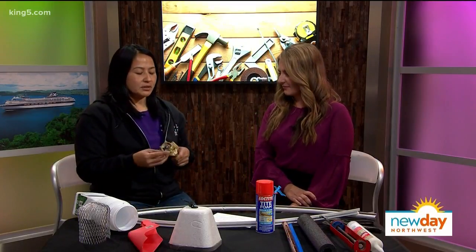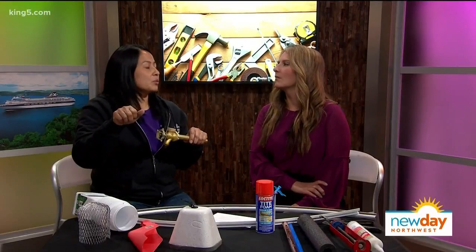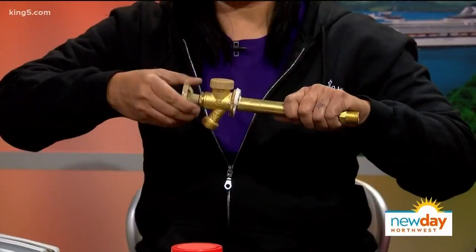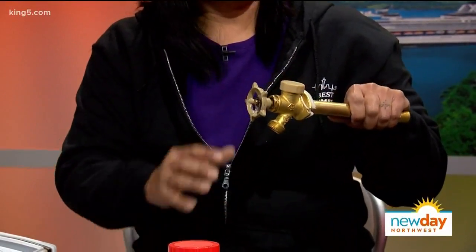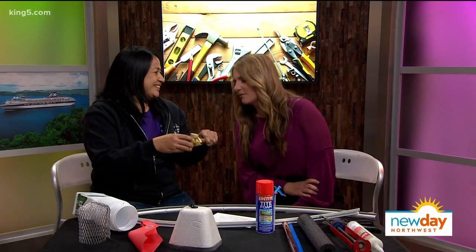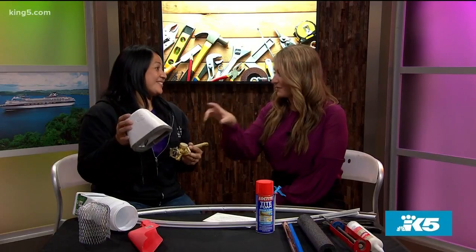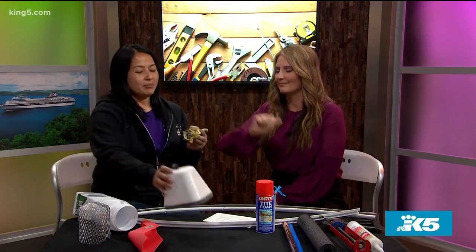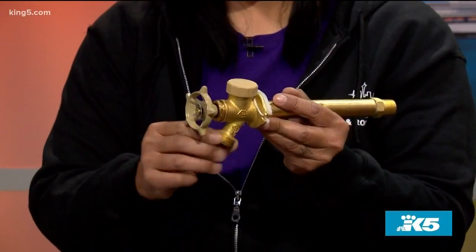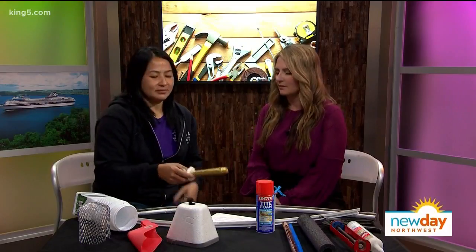With winter coming, you want to drain down your hose bib so it doesn't freeze — otherwise the pipe would freeze, bust, and you'd have a flood. If you have a shutoff valve in your house — most older homes would have it — shut off the valve, go bleed the line out by turning it on, and the water will come down. Older hose bibs won't have a vacuum breaker, which prevents water from being trapped inside. This is the faucet cover — I have one on every single one in winter. Most importantly, detach your garden hose from the summer before you do all this, then use the cover. You don't want water stuck in the hose and then freeze.